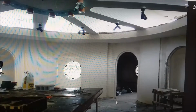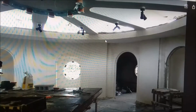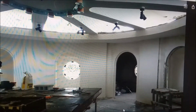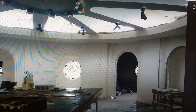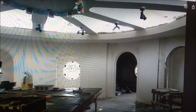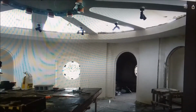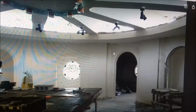See, this is an atrium, and this plywood is just sitting on the supports that we had when we poured this upper floor up here and the spider beam. Those stands are the same stands that we used for the downstairs house to pour all the rest of this floor. And we were just storing them. So we said, well, cap that off, and we'll take some of them apart and make them for the shorter height. So we put a second set of stands on top of this temporary floor. And it was really stiff and stable. I mean, it was absolutely solid.